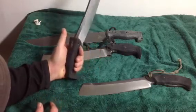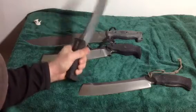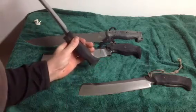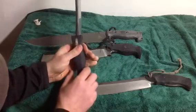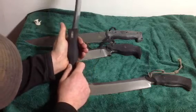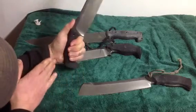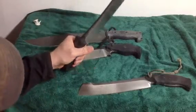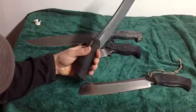What I was finding is, when I didn't relieve this back here, I was chopping, and the blade was steering. I would chop, and it would steer this way, like into my knuckle here. And so when I'd chop, it'd make me scoop stuff. This space right here was pushing the knife away from my hand more like that. So when I gave it a recess, and a place to nest, it could form this straight line that would go right in there, and line straight up with this plane of my wrist right here. And that allowed my striking when I was chopping to become more accurate, in a sense.